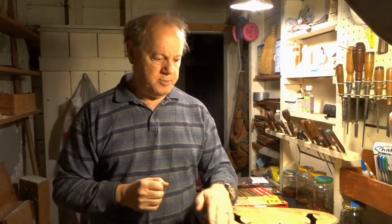You want to use your hands as well as your eyes. You should be well-lit and look at your workpiece from many angles so you can see any imperfections — bits of tear-out, scratches that remain. Remember, those will show up under shellac, and the more glossy the finish gets as you apply more coats, the more they will tend to show up. Your fingers are in some ways more honest than your eyes — you're trying to feel for dips, then re-sand to flatten them out. Any dip will show up under polish, so be very meticulous.